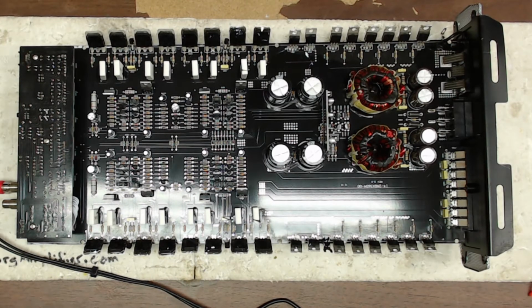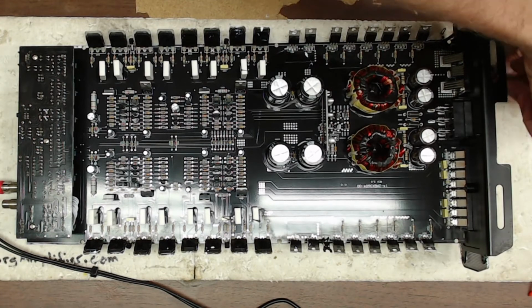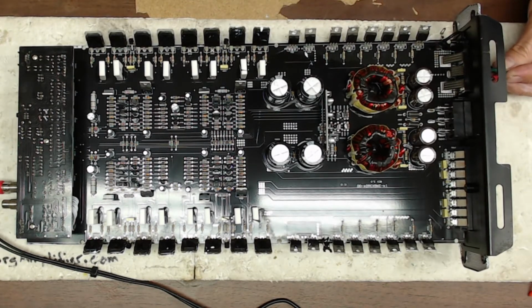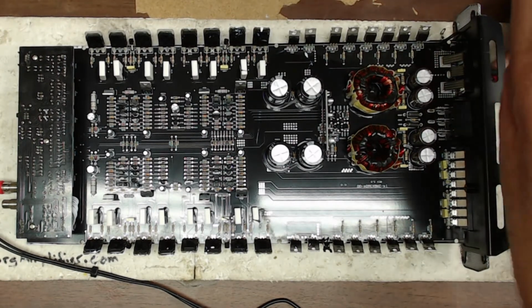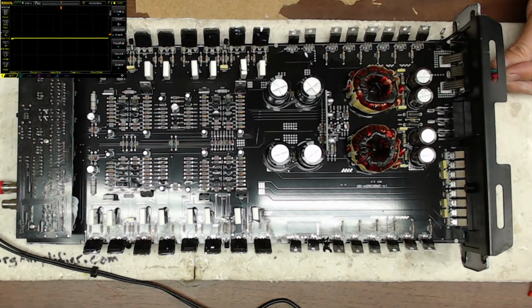So let's get some power hooked up. Ground, remote, positive. Where's my, let me get my channel one lead here. And let me get the scope set up for you guys. All right, I got the scope fired up. Let me make sure all my gains are turned down. It does help during testing to make sure all your controls are counterclockwise.